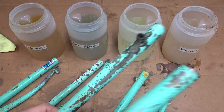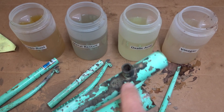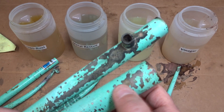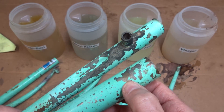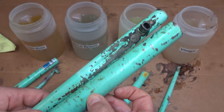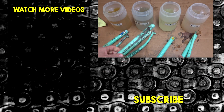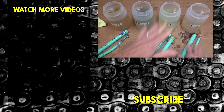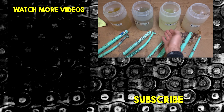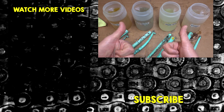Comparing what they did as far as de-rusting: the oxalic acid did seem to get rid of the rust but left kind of a dark rough residue, whereas the vinegar got down to cleaner metal than the oxalic acid. They both changed the color of the paint, though looking at this I'd think the vinegar actually changed it a little bit less than the oxalic acid. It's kind of a toss-up between cheap-but-not-quite-as-good versus slightly more expensive and doing a slightly better job, but neither one did nearly as good as the Evapo-Rust. So I would go with the Evapo-Rust. Thanks for watching and I'll see you next time.